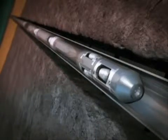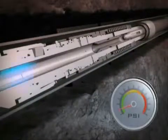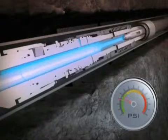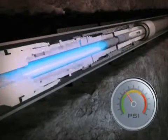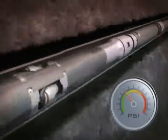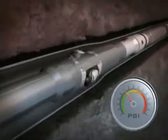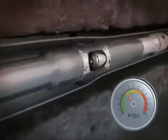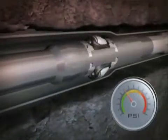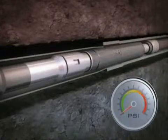The BHA tags the first EZI joint, positioning the tool for activation. Flow through the BHA provides sufficient back pressure to activate the diverter isolating valve, shutting off the lower ESS expansion tool and allowing the pressure to build in the EZI expansion tool. Expansion is achieved with rotation and forward movement. At the required length, pressure is completely reduced, allowing the diverter isolating valve to return to its original position.